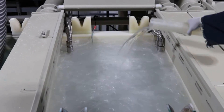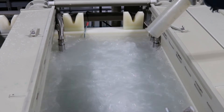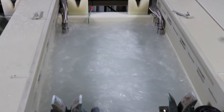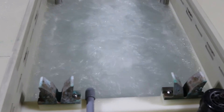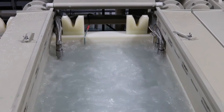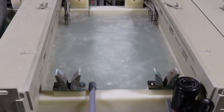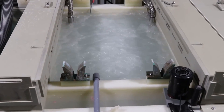Let this mix in well. After 10 to 15 minutes, remove the rinse water by pumping or draining into an appropriate and well-marked container. If it is still relatively clean, you can save the rinse water to use again. Finish by spraying the tank with deionized water before filling the tank again with the electroless nickel bath.